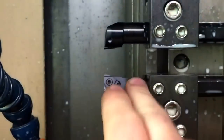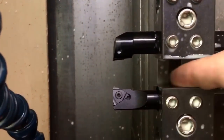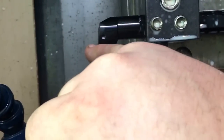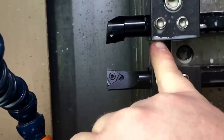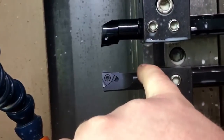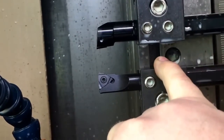So I tried minimizing stick out on both of these. I actually ground down the surface here and here so that when I machined down the bar — the actual stock piece of material — this tip is below this area here. Same thing for this one: the tip of that insert is higher than that. Otherwise they would crash into the tool blocks. Those are all indicated in so that they're perfectly perpendicular to the work.